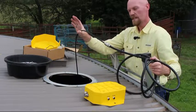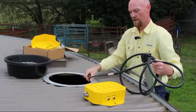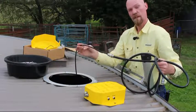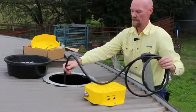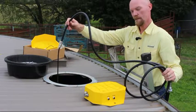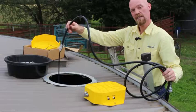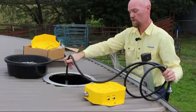After about three meters, you'll have an unprotected section that goes inside the tank. Make sure that from that point onwards, livestock and pests can't get a hold of it. If you're going to expose any of it, you'd like it to be exposed only up to at least that protected level. If any bare cable is exposed, cockies or other animals can get a hold of it and chew it, which will stop your reading.